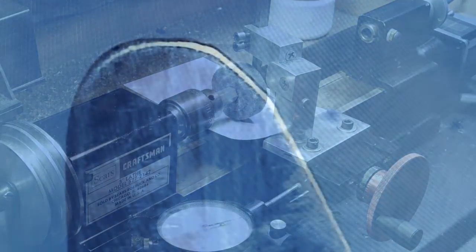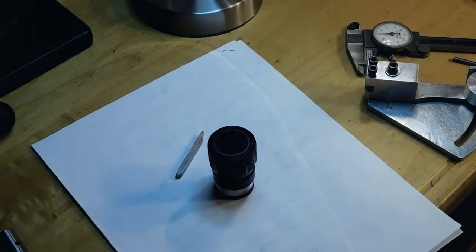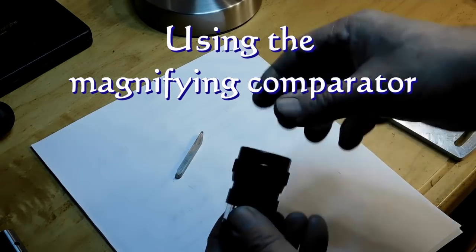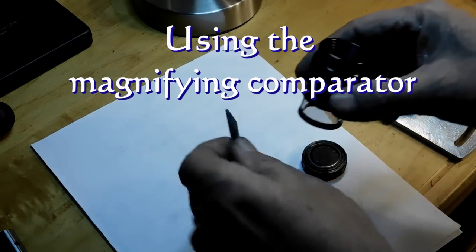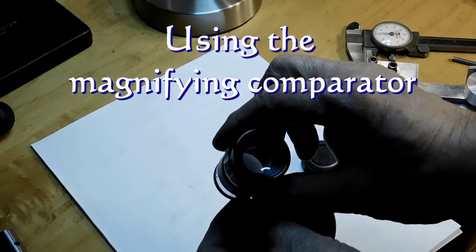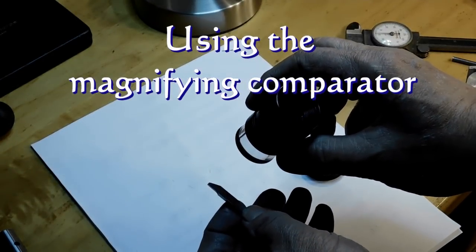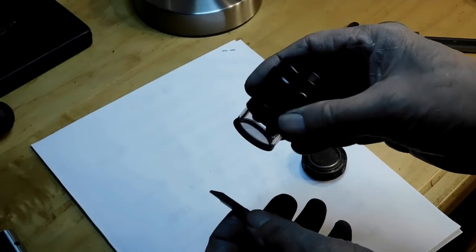There's the finish cutter, and right from there to right there — that's the cutting edge. As a last step before continuing, I took this optical comparator and took a look at the radius under it to make sure it was the right size and had the right shape. It's a good close-up way to measure it, and everything checked out fine.